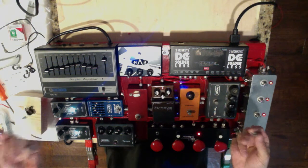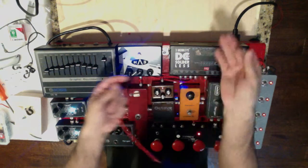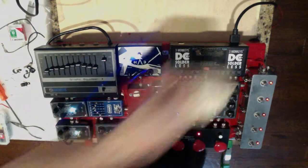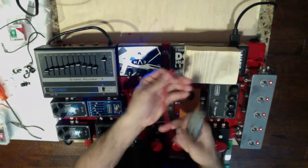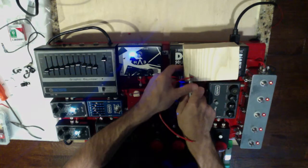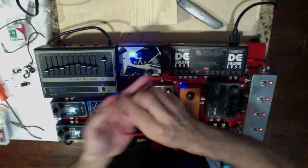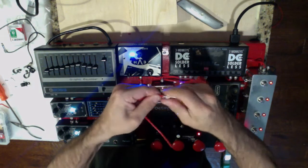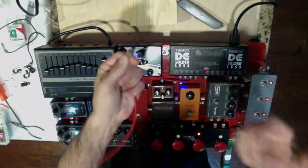And as I've stated before, it's a very simple system. There's no wire stripping involved, no tools involved. Basically, the way that you make a cable is to take yourself a knife. That's the only thing you need. One of your ends, some of the Three Monkeys cable. Cut yourself off a little bit to make yourself a clean cut. And then take your end here and literally just screw it on, thread it on. And when it's on, bottomed out, nice and tight, you're done. You just made a cable.